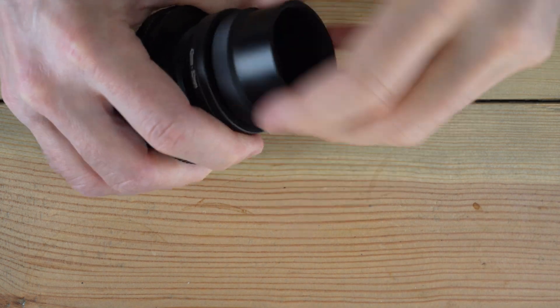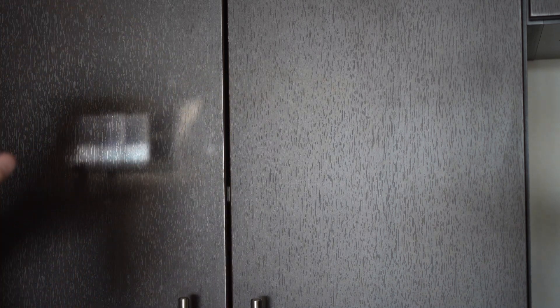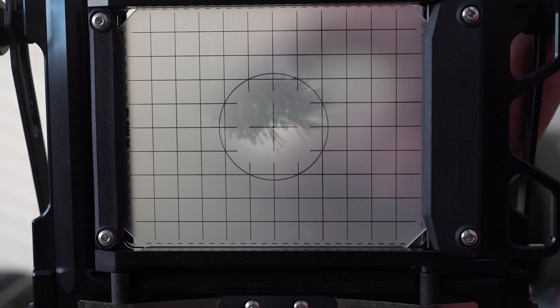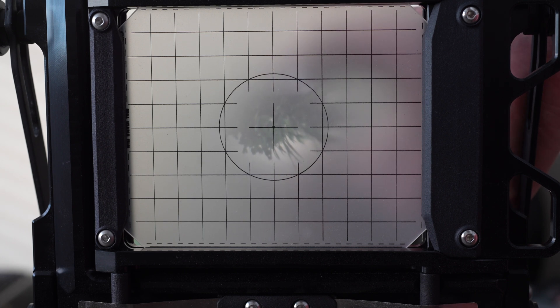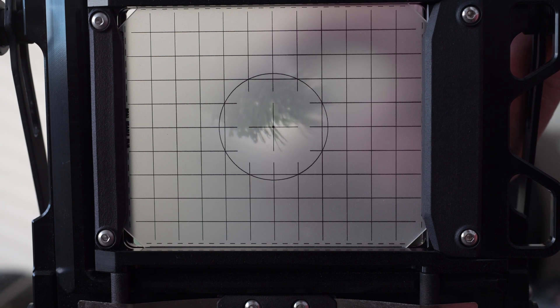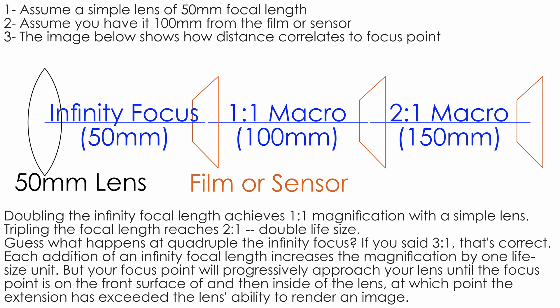For image circle, here's a tip. You can check the image circle of a lens in a few different ways. Use a lamp and your hand to see approximately how big the image circle is. Use a sheet of black construction paper and a window, which will give you an even better and clearer definition of the image circle, and will give you the ability to check it at infinity focus. The latter also will give you a way to approximately gauge how sharp the lens is. And if you want to go crazy, use a piece of ground glass — either a large format camera itself, a ground glass from a large format camera, or even a piece of clear rigid plastic that you can take some fine sandpaper to, and that will make your own ground glass for cheap. You can hold the ground glass between the lens and your eyes and get a really good idea of how the lens behaves, the image circle, and the sharpness. I use all three, and it depends on the information I need at the time and what tools I have sitting next to me.